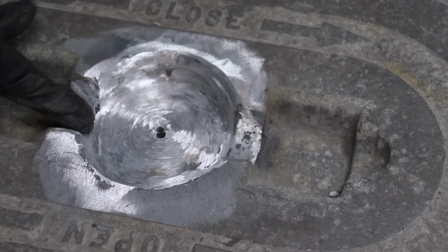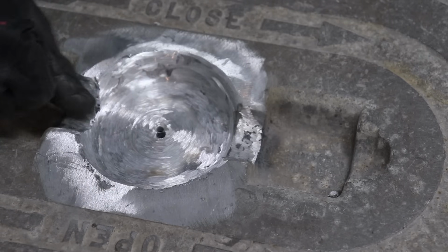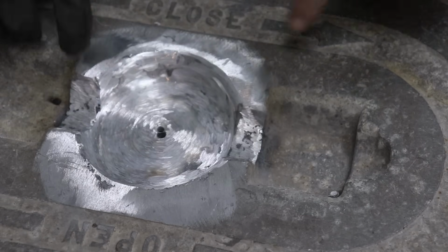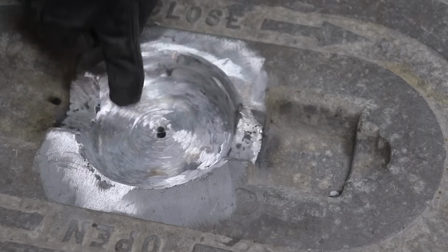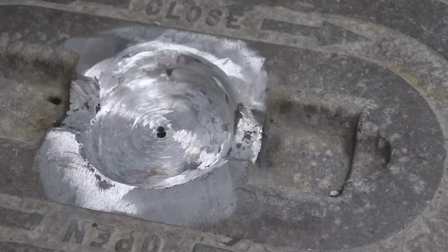This stuff I hadn't added any filler material to yet, so I'll do that now. I want to make a nice landing for the handle to stop against. Like I mentioned, we don't want the bead on the inside of that handle. We don't want it impacting that plastic seal. It'll destroy it relatively quickly. First time somebody stomps that handle down, it's done.